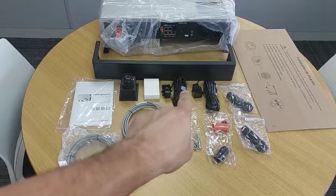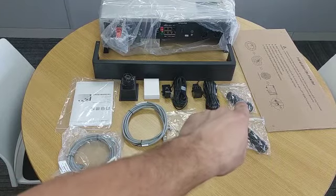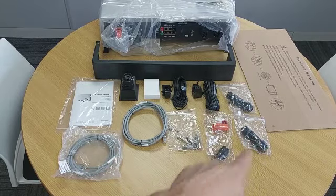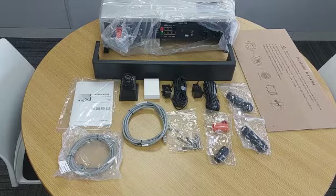Two CT clamps — one grid, one PV. You'll get your AC plug, so that's for the power going to the unit. An EPS plug, so that's for the emergency power supply — obviously just respect the fact that it's 13 amps limited.